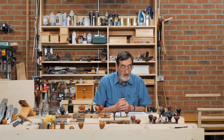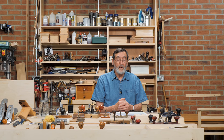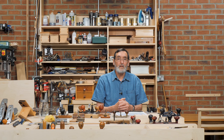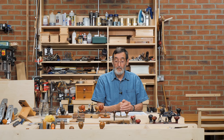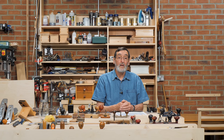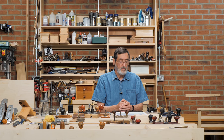He also asked: do you recommend attaching a wooden support screwed to the base of the plane? I do, for most things. Wherever you have metal approaching wood there is usually marring to the surface, no matter how smooth or well-made the plane is — it seems to always be able to mar the surface, especially on softer woods. Whereas wood on wood very rarely does. So I would definitely recommend having a wooden plate attached, not metal, and you can always take it off if you need to for whatever reason.